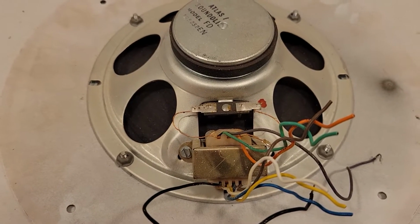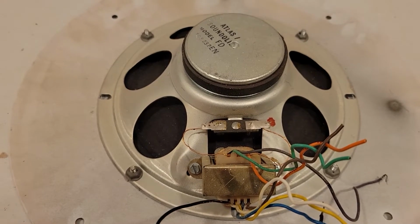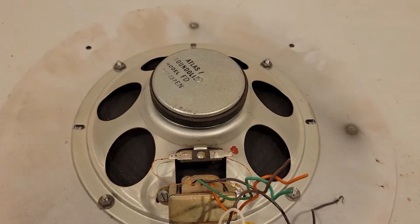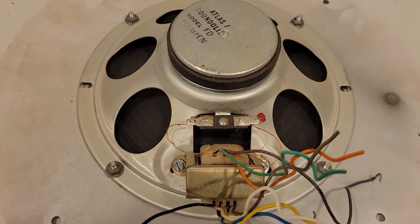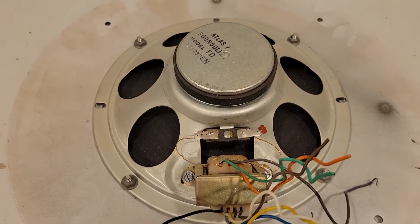And you can't go over that, and even in best practices you want to stay a certain degree below your amplifier maximum, but you can go underneath it. So even if I set all 3 of these to 4 watts, that'd be 12 watts, which would be less than the 30, so I'd be good.